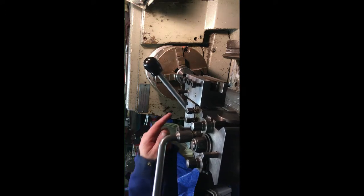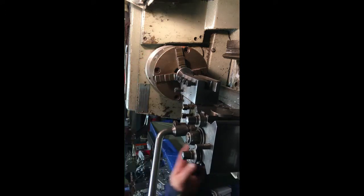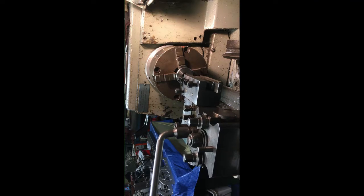I've already touched inside the bore with the tool so that I know when it's at its home position that is my zero starting point. I've also set my dial to zero on here, so I'll put my first cut on and then run this down through just to see how we get on.